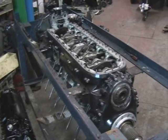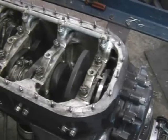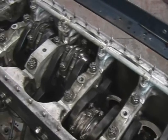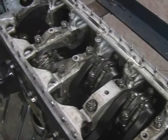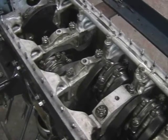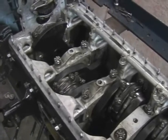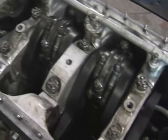We've got the crank and the rods in. We've done as little as possible in terms of cleaning on the engine — we just want to keep it as original as possible. That said, we've had to have the oil plugs out of the crankshaft in order to clear the sludge out of it, so the whole thing's been apart. And it all looks in really good condition.